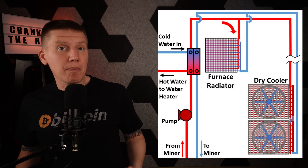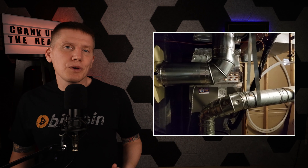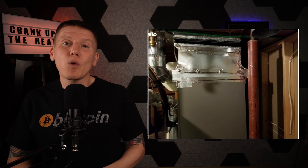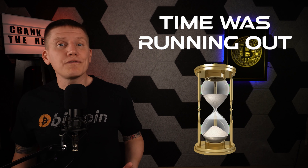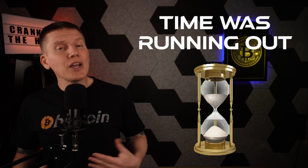Here are a few photos of my radiator install. As you can see, the radiator was a little oversized — I couldn't find one exactly the same size as the existing ductwork, so I had to adapt the ducting to make it work. I didn't do a very good job of building this — instead of removing the old ductwork and rebuilding new duct transitions above and below the radiator, I just attached it to the top of my evaporator coil with some angle stock, cut and bent the existing ductwork around the radiator, and used a ton of aluminum tape to fill the gaps. The reason for this sketchy build was that I knew my existing HVAC system was not going to be there for very long — it was well over 15 years old, and the furnace fan had already started to fail, with only one of its three speeds still working.